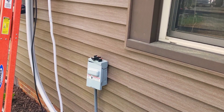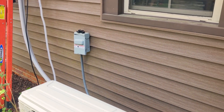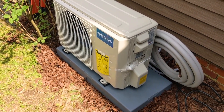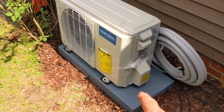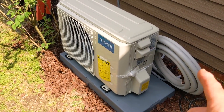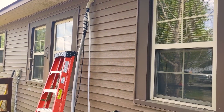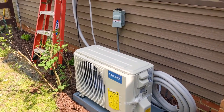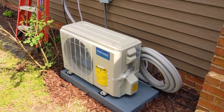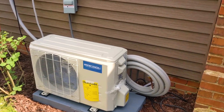The most important thing on this 12K unit: it is a 115-volt model, so make sure when you install your electrical disconnect that you've brought a 115-volt, 20-amp circuit out to the outdoor condensing unit. We've got anti-vibration pads under it and we'll fasten it to the base shortly. It's going to run on solar — stay tuned for more Mr. Cool experiments. We've got some other tricks up our sleeve, including making Mr. Cool a solar mini-split.